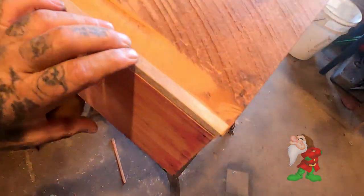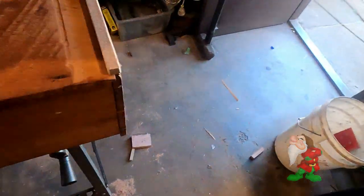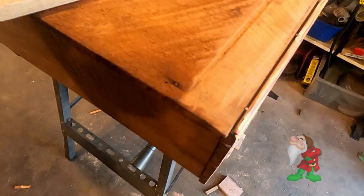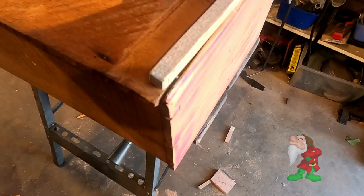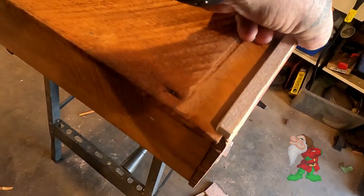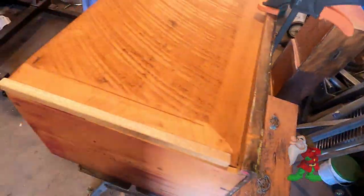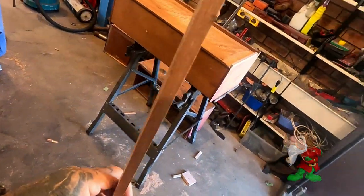And then put some clamps on the sides just to hold it down, and then try and nail it. I don't know whether the nail's going to be overly successful. They should reach. Even if I get the nails just to hold onto here, just sort of skew nail it a little bit, the glue will hold, do the rest. That should hold on all right. And then I'll do the others if I've got enough. I don't think we're going to have enough of this, but if I have to, I'll do the other long one, and I'll go in tomorrow.